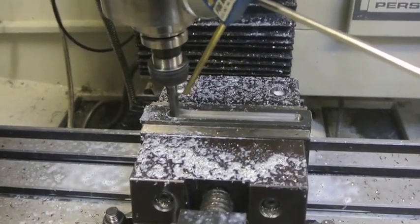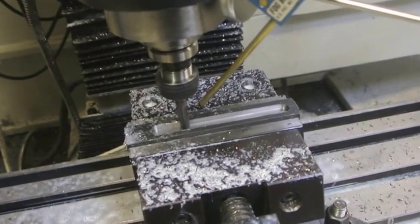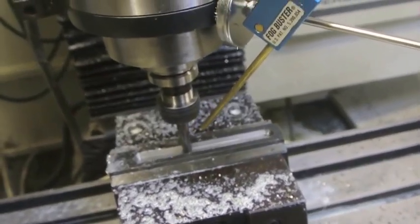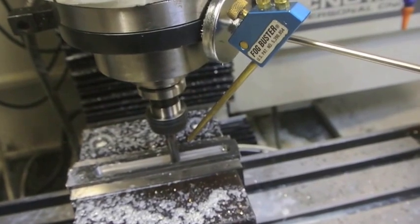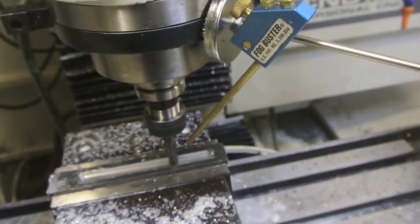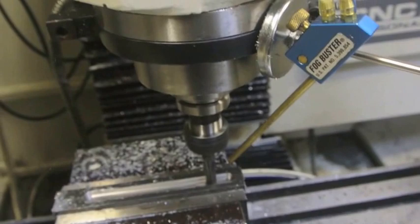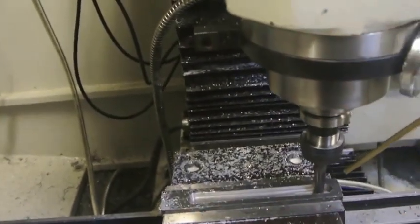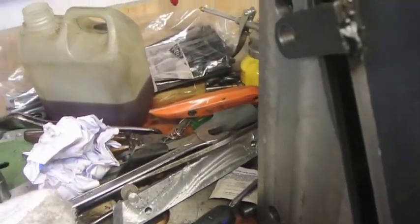I've just started to knock out some links. I think this cutter has a chipped tooth - it makes a lot of noise on the quite soft metal - but it's cutting OK so it's fine. There's one link there. There's a hole in the bar at this end, and it fits onto a link that goes between this hole here and this hole here, and provides the means of locking the table at different angles.